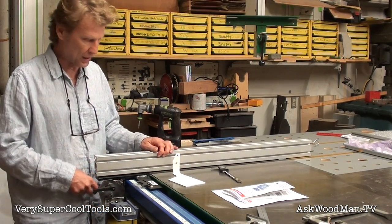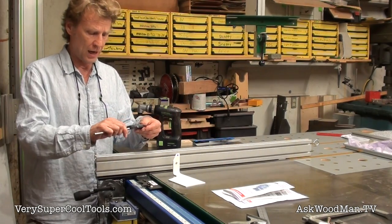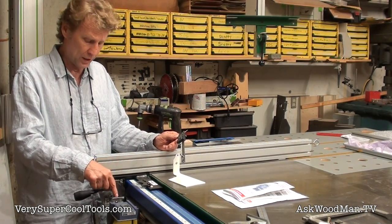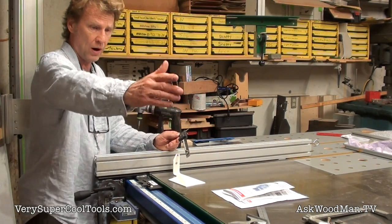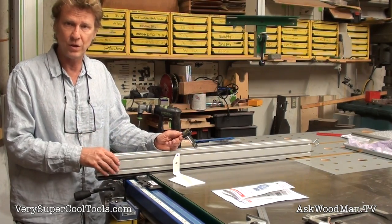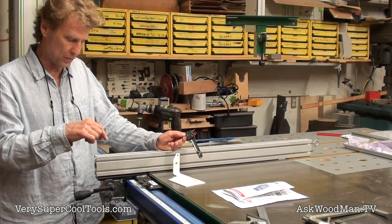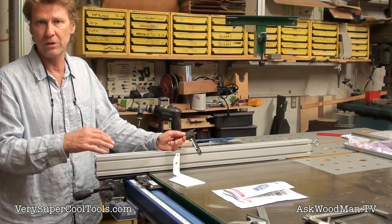The way you set this, you just take an arbitrary practice cut and take a reading with your digital calipers to the thousandths of an inch if you want, punch it into the readout, and now anywhere on the scale you're going to be reading to within a thousandths of an inch. You're able to, just by pushing buttons, change from sixteenths, thirty-seconds, sixty-fourths, or millimeters, or centimeters.